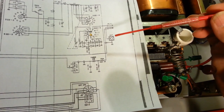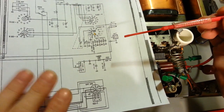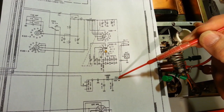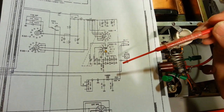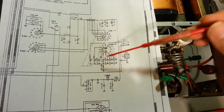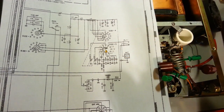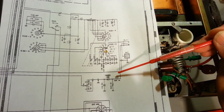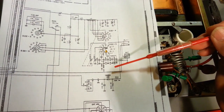Now, without pulling out the manuals for every specific radio, I can't be 100% sure, but the final circuit in all the Kenwood hybrids is pretty much exactly the same. But the part numbers may be different. I can't be 100% sure, like I say, without going and pulling all of them. Now, this is actually the schematic for this radio, a TS530S. So there's several other hybrid radios. If you look at the schematic, it's going to look exactly the same. All the capacitor values, all the parts, they're going to be exactly the same. It's just the part numbers might be different. So in your case, depending on what radio you're working on, the part numbers might be different. But they might be the same. Like I said, I just can't remember if they are same or different.